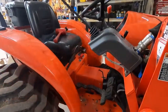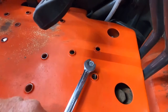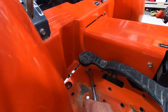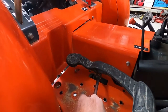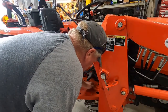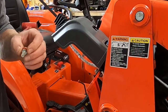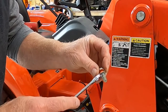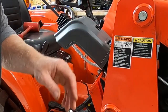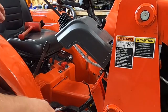All right, so the first thing you've got to do on the other side — you'll see down in here you've got to take out these HST pedal stops. That's all they are: 12 millimeter, one here on the forward and one back here on the reverse. They have to come out, then the two bolts for your actual treadle pedal for the HST have to come out — four bolts total. Those HST stops have a jam nut on them that you leave in the same spot from the factory. The jam nuts set the height for your treadle pedal for forward and reverse — don't adjust this at all, just leave the jam nut right in place.